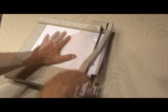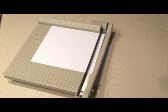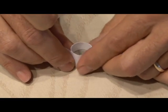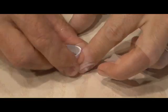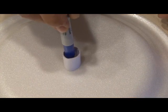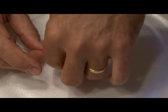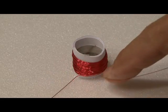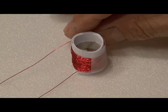The first step is to cut a couple of strips of paper that are wider than your magnet is tall. I cut two three-quarter inch by 11 inch strips of paper. Take one strip and wrap it tightly around the neodymium magnet and secure it with scotch tape. Then wrap the second piece of paper around the first and secure it with scotch tape. Take the magnet out, mark the center spot of the styrofoam plate, and hot glue the tube down. Reinsert the magnet, secure a small piece of wire to the tube, and begin wrapping the tube with wire. I wrapped it 60 times and after checking it with an ohmmeter, it measured at 7 ohms. Be sure to tightly secure your coil with scotch tape when you're done.